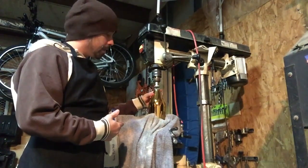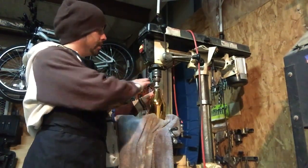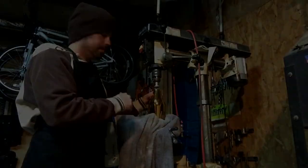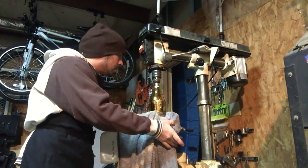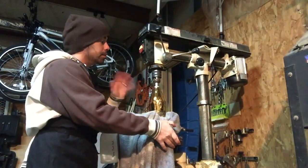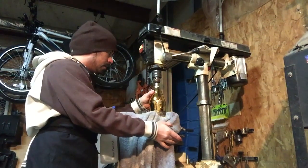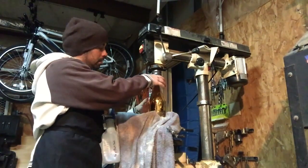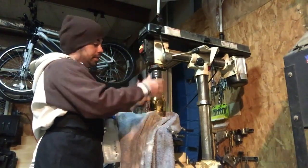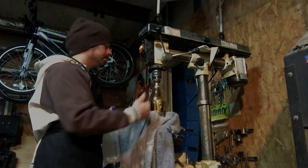You always want to use water when you're drilling glass. You want to go very slow with a very fast RPM — set the highest RPM you can — but apply almost no pressure when pushing down on the drill press. For my setup I use a telescoping drill press and a milling vise, which gives me all degrees of adjustment: up, down, left, right, back, forward. That way I get the most accurate drill straight down into the bottle. I couldn't imagine using a regular drill press with no articulations and no milling vise.